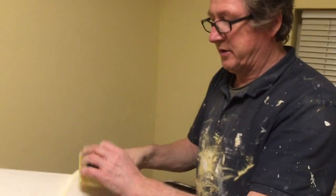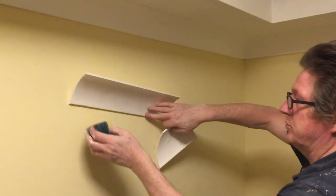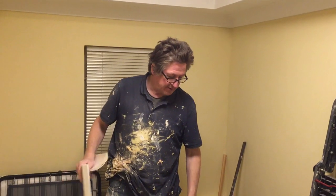If you are applying it, just have a bucket of water ready. When you're doing it, just wipe it off and keep yourself clean as you go along. Once you've pressed it up against the wall, wipe off any excess because it sets like cement — literally as bad as Artex or whatever people used to stick coving up with in the old days.